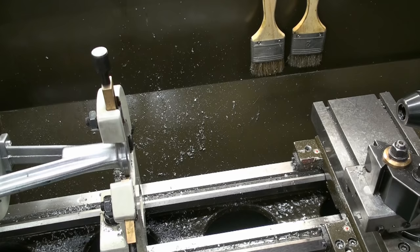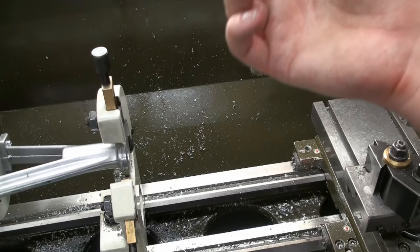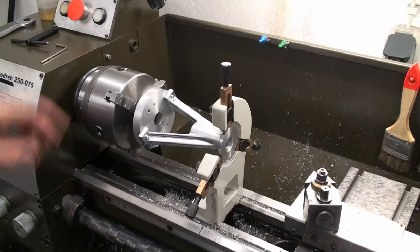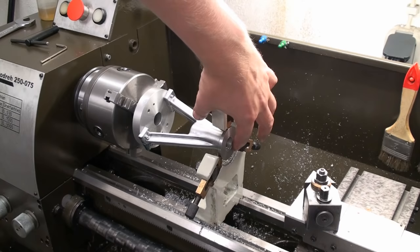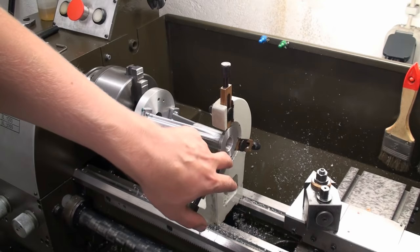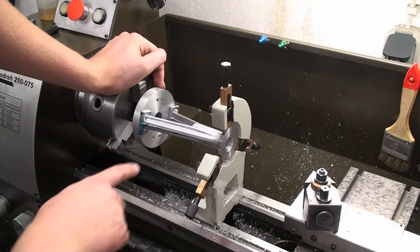And a nice thing on a small scale steam engine, it will run in and wear in, and after some use all the tool marks will be gone and it will run super smooth. Okay, I machined in front here a recess 1 millimeter deep that will later align the cylinder on the A-frame. I machined that off camera, it's just boring. Boring to depth, almost like a countersink. That's all the turning work that's to do on the A-frame. Now we can tear down the setup. So let's take the setup apart.